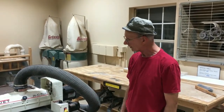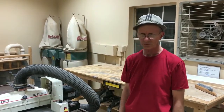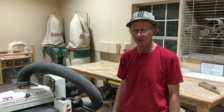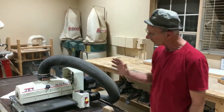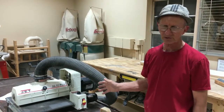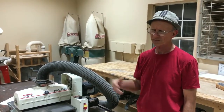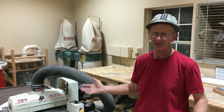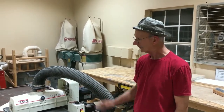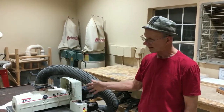It's a piece of equipment in our shop that we have a lot of difficulties with because it's easily abused. It looks like a big sturdy machine, but you really got to be gentle with it. People will run finished wood through there with paint or shellac or varnish, trying to get rid of that old finish from furniture. This is not the machine for that — it will blind the sandpaper. This is like sanding on steroids.